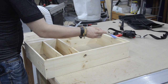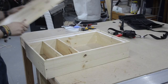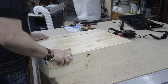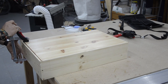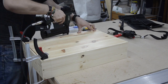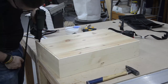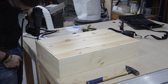The cabinet is later hung on its rear plate, so it carries the whole weight. That's why I didn't use a thin veneer plate or something like that, but a rather thick, solid wooden plate. It's difficult for me to put lamellos in here and I don't want to rely on just the glue, so I nailed the rear plate additionally. Maybe I overdid it. A little bit.